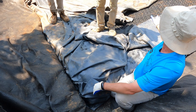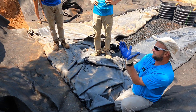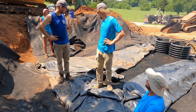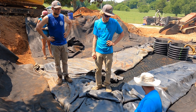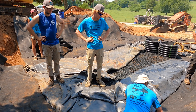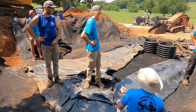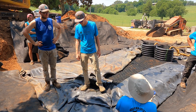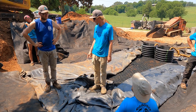When you pack your dirt in, you're just going to leave a V — the gravel from the blocks comes down in a V. Then you pack dirt, and when you fold the liner back, the only successful way to do that is to build your soil up from that at an angle so you end up with a V. When you fold the liner back over, you just have a small trench and fill it with gravel.